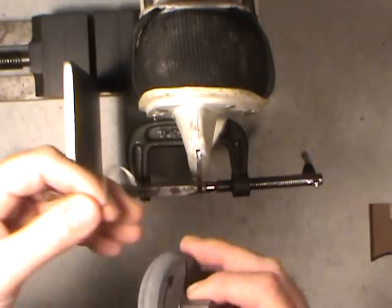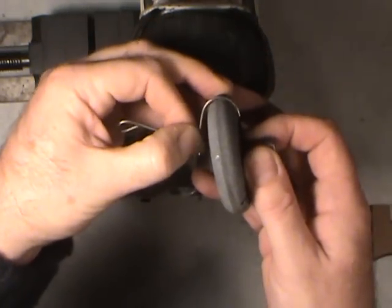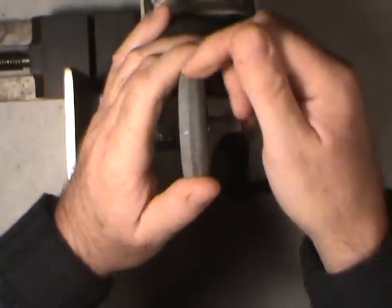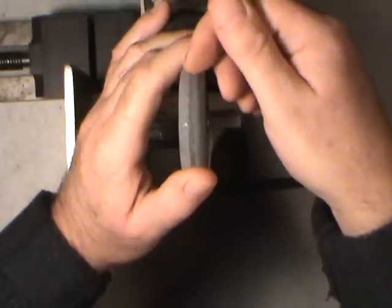So what I do, in order to dress this thing, is I have to make sure that it conforms at the part where it's touching down. So that radius is actually only conforming to my gauge on the center section here, only about a quarter of an inch.